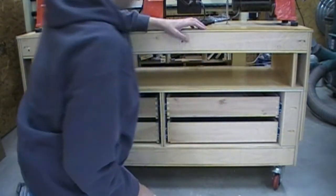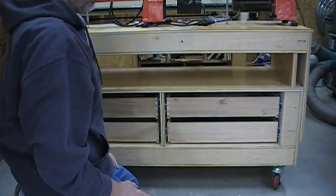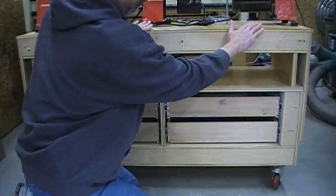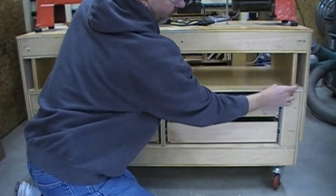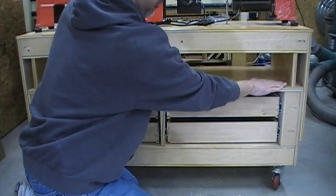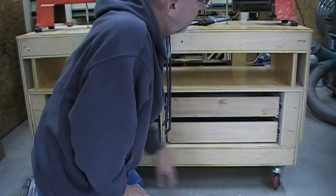That shape captures the base and doesn't really allow it to go very far. When the stand is in the upright position, the weight of the lathe sits on these little hinged blocks that can flip up and let it come down. When it's at the bottom, the weight again sits on those blocks — not on the gears or on the sides. The sides only come into play when you're actually lifting or lowering the mechanism.